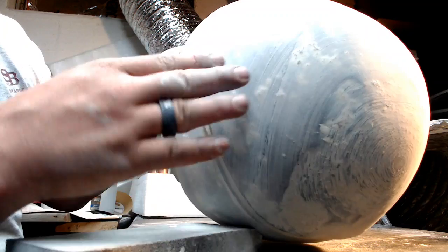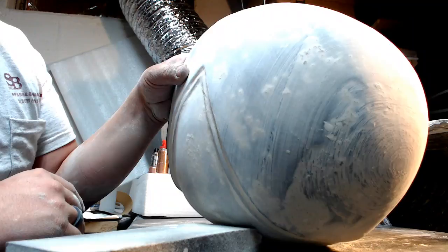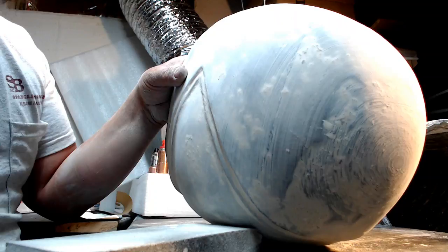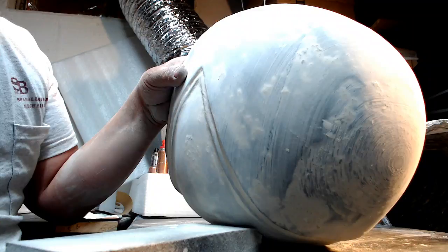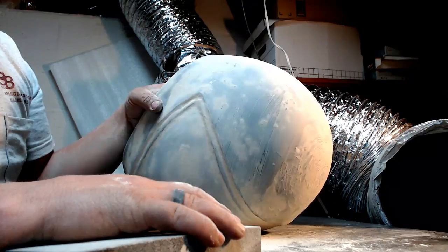When I hit this with wood filler primer, it'll be smooth. It'll be ready for the first coat of paint immediately after the filler primer. I probably wouldn't necessarily have to sand the filler primer spray paint. I probably will give it a light high grit sanding. But that's where I'm at this point, 3D Gussner, and anybody else who joined in, just to give you an update on it. And I'm just sitting here sanding.